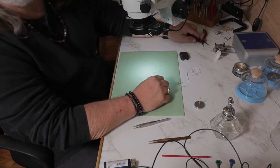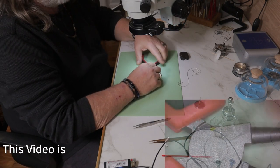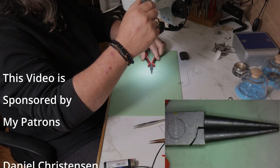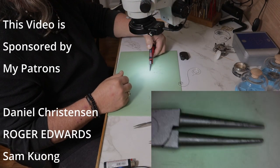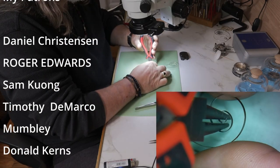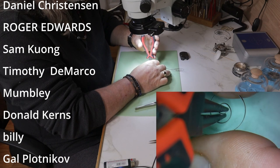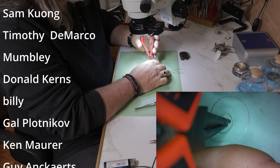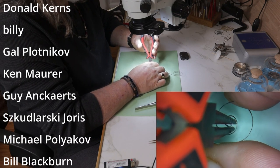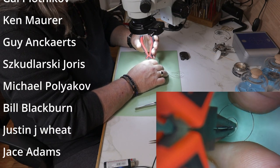Once the coil has been softened, I use a pair of round needle nose pliers to hold on to the end of the inner coil by clamping down right where the hole for the hook is. These pliers will not only help shape that inner coil but they also prevent the coil from getting crushed at that weak spot by the hook hole.